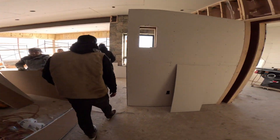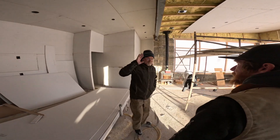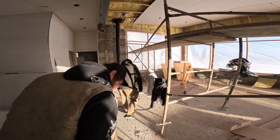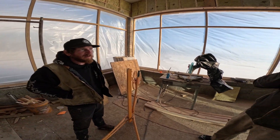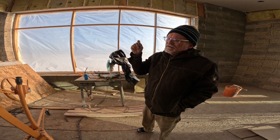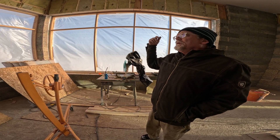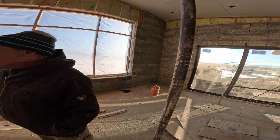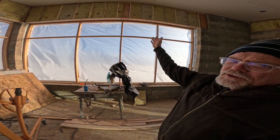We've got big south-facing windows coming in. Cardinal Glass has an online tool where you can specify thickness, dimension, solar heat gain, and U-value, then have them made through a glass person. I tuned these windows for high-end heat retention. They're going to be operable so in the summer we can open them, with ceiling fans here and in each of the bedrooms.